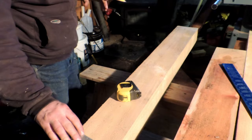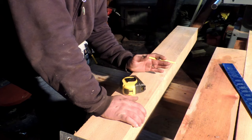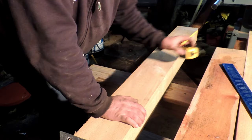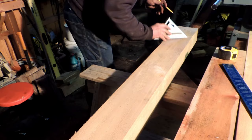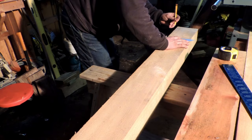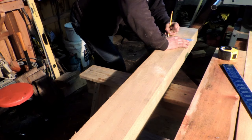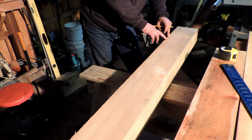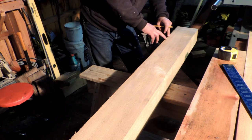All these joints are getting put into a half-inch housing. They're going to be recessed into the wall posts and the tie beams. So you have to account for that when you're cutting this brace. In order to account for that housing, I'm going to take my speed square and a good sharp pencil — number one rule. I'm going to measure 3/8 of an inch up on this. That measurement of 50 and 15/16 inches, I'm going to go from this point. But first I'm going to lay out this end of the brace, taking my 45.